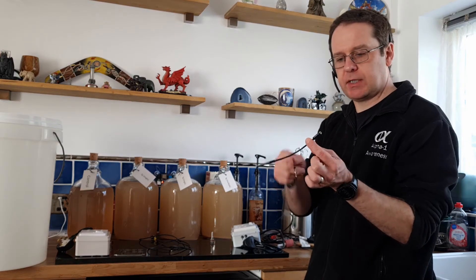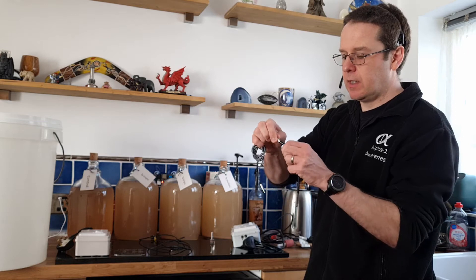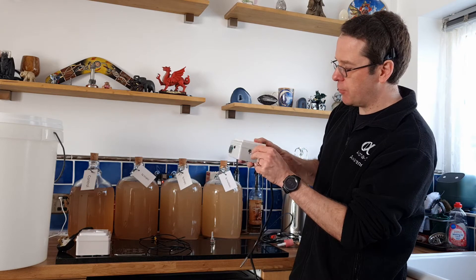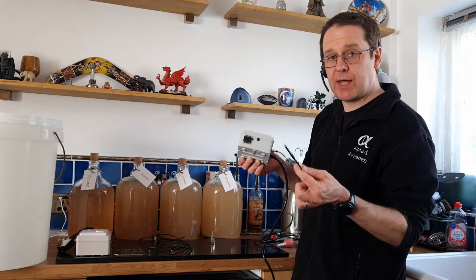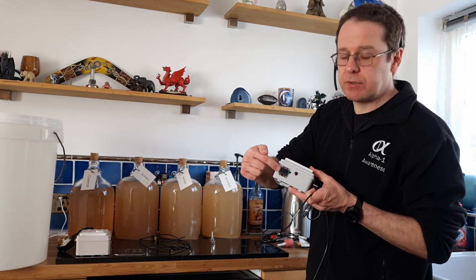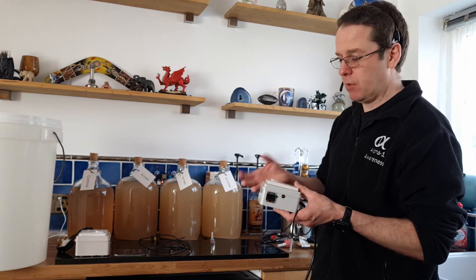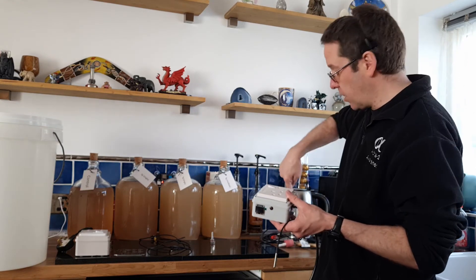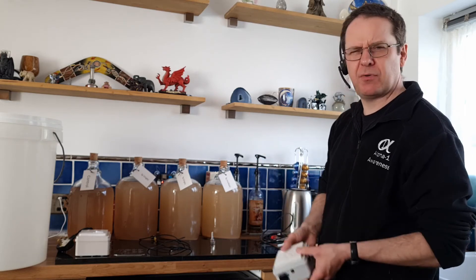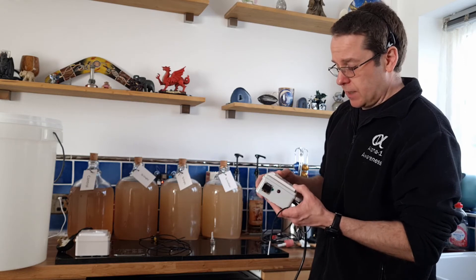I have this sensor on a connector on a three-and-a-half-mil jack, which plugs into the T for temperature input. This will monitor the temperature of the brew and show it on the screen. When it notices it's too cold, it will turn on the heater — the power to the output plug. You can use this immersion heater, brew belts, underheaters — it makes no difference. It just works.